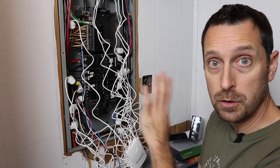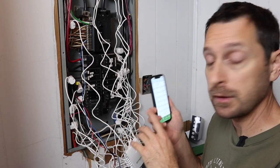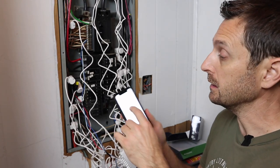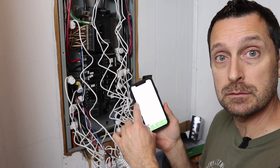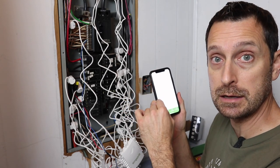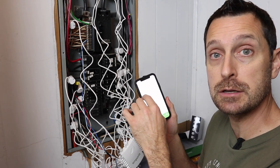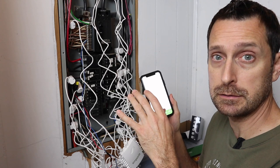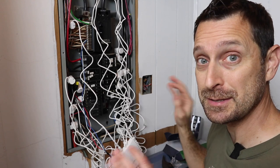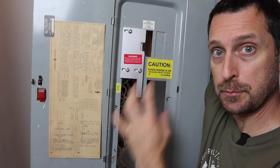You really want to turn this on before you close your panel because you want to get connected to the app first. You can see the little green light is on on the hub. Each number on the hub corresponds to a sensor, and that sensor corresponds to a breaker — so before I close it up, I need to go into the app and label them so everything is organized. For my larger loads I have some labels on the breakers, but since this is a really old panel it has a chart, and I have everything written down to match to the proper sensors.